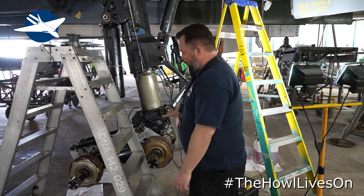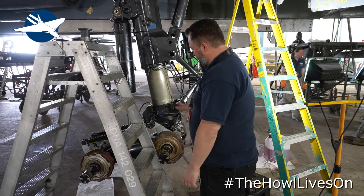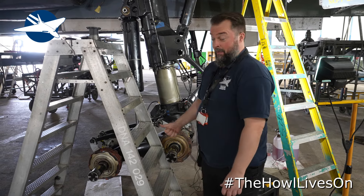The brakes have all been into the workshop, all been resealed, all been pressure tested, some new hoses made, hoses pressure tested — so 150% of the working pressure. Everything goes back on.